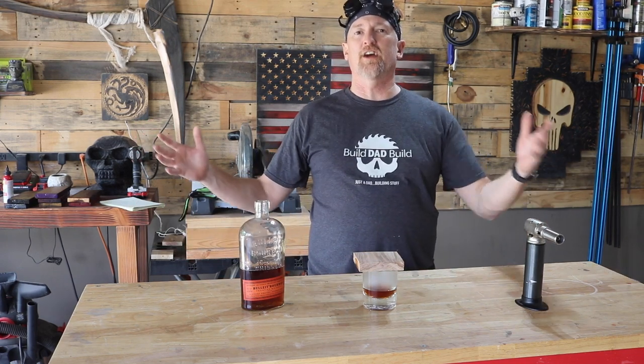One last thing I want to address. People have asked me in the past how I deal with cupping of the boards and whatnot. Now, to a certain degree, this technique is going to lend itself to like a more rustic look, right? Your boards are always going to have a little bit of variation in them, but to reduce cupping and warping, a lot of times if you spray the board as you burn it, that will reduce it some. If you do notice quite a bit of cupping or warping after the fact, a lot of times if you burn the backside of the board, it'll cause it to settle down a little bit. One thing I've also discovered, you heat that backside and then you put some weight on it, and a lot of times you can flatten it out that way as well. So that's just another little tip for you guys that decided to stick around.